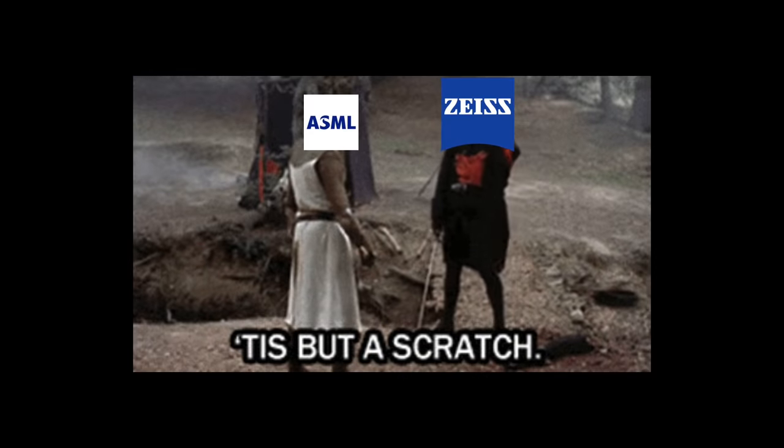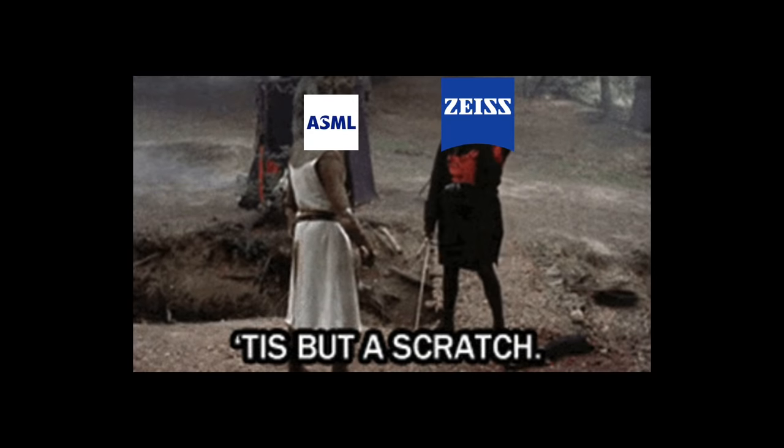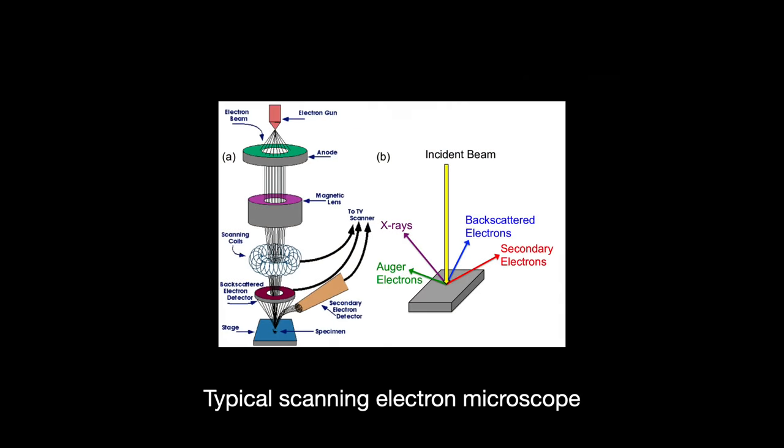Blank or absorber-related defects will happen no matter what. These have to be detected and repaired. In the optic system for the 193nm DUV lithography generation, defects are detected with a scanning electron microscope. For EUV, they needed to do more, as some types of reticle defects are invisible to an electron microscope.